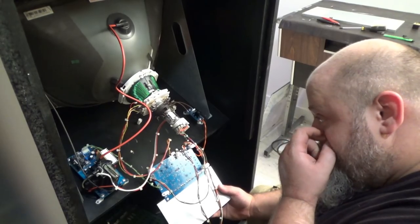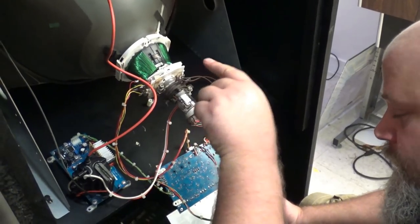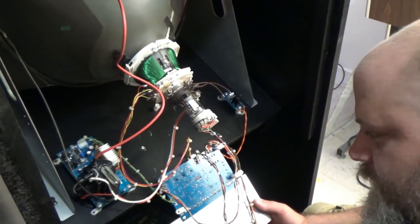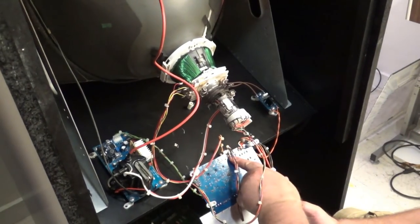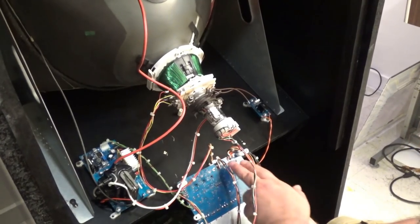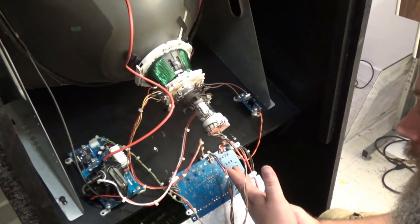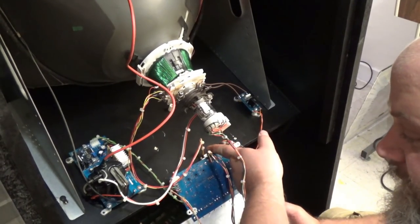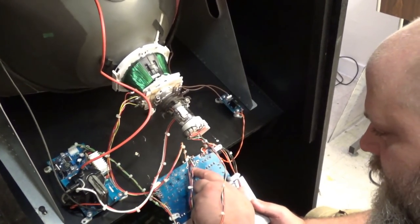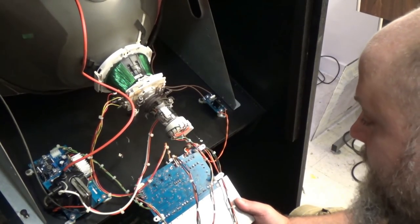I plugged it in and I had a dot in the center of the screen and the beam just went straight down. So I double-checked my connections and I see that I did this entire VGA connection wrong — I did it the mirror image of what I was supposed to do. This shouldn't be a problem for you if you're going to use the connector like you should anyway. I'm going to disconnect these wires and solder them in the reverse order — that should clear this up.